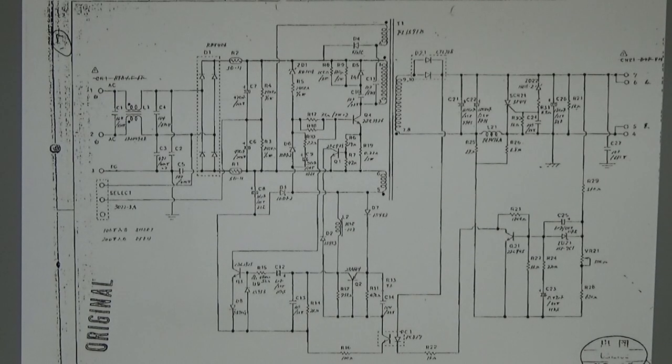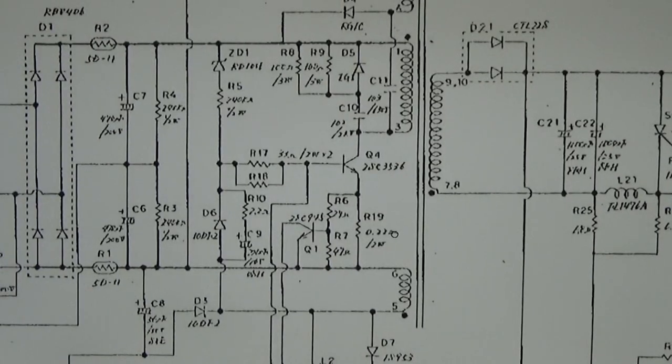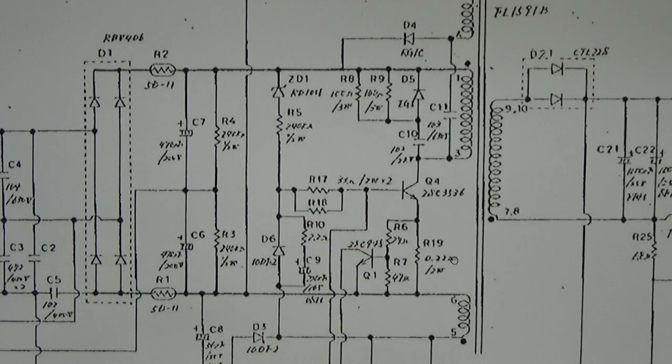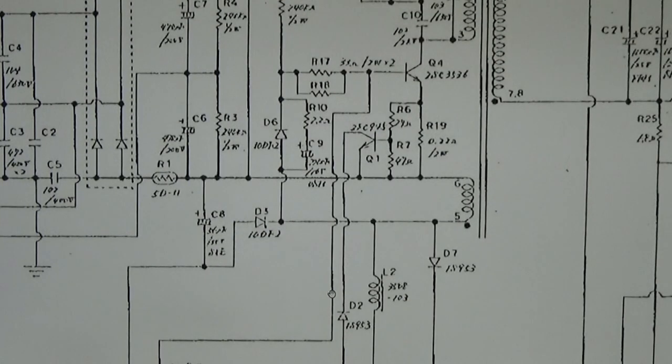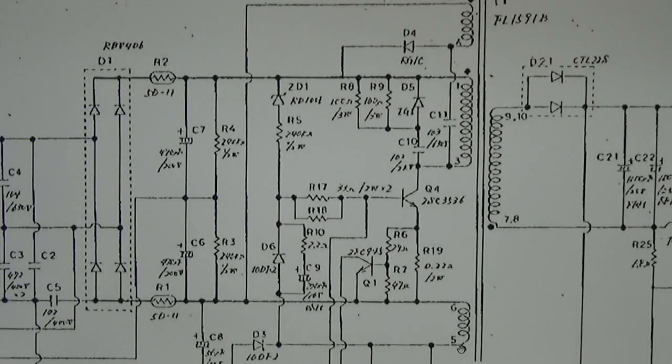And what we have here is our original schematic for our power supply. And well, it is a little bit confusing if you are not used to reading those schematics. But what we see, we have here our coil, and that is here our transistor for the flyback converter. And you see that we do not really have here a start or a standby circuit, which would have a separate voltage and a separate oscillator, which would start the circuit. So this here needs to start up the oscillation by itself,